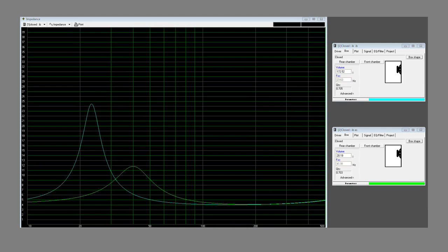Another thing to point out is the resonance. The ideal acoustic suspension — at about a third of the driver's VAS — has almost doubled the resonance frequency of the driver, tuning at around 42 Hz. The infinite baffle, on the other hand, only shifts from 20 Hz to 23.6 Hz — barely affected. Its higher compliance is also an indicator that the speaker is moving more freely, which is why it gets so much more output at those very low frequencies.